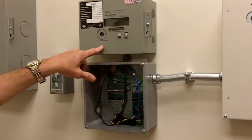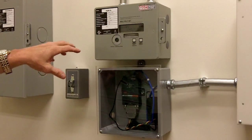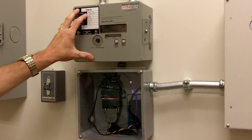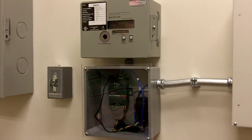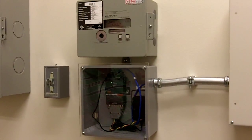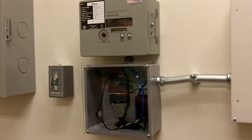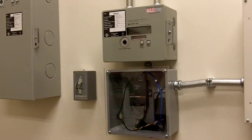This is a single three-phase meter. There are three 200-amp CTs on the main service out here at Eldico and this is what it's recording right now — collecting all that data. Every 15 minutes it takes a snapshot of what kilowatt hours are being used and everything. It has your phase angle, power factor — I mean, everything. It's just a lot of stuff.